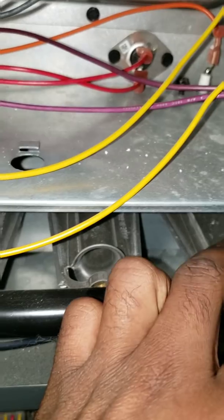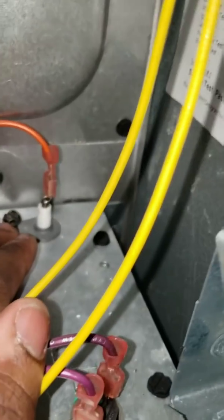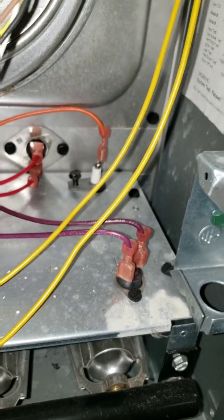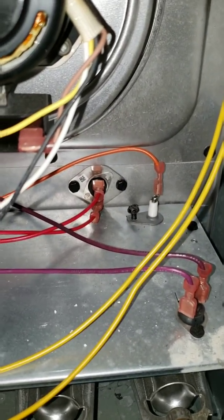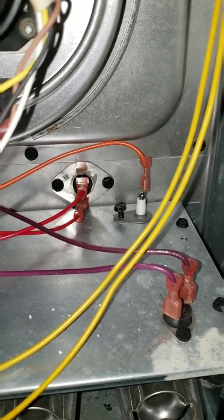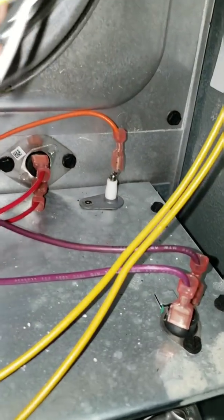When the flame comes out, the igniter is here and the flame sensor is right here in the back. You're going to need a flathead screwdriver for that. You take out the screw, disconnect the wire, pull the harness, and pull the flame sensor out to replace it. The temporary solution would be to just sand it down — and like I said, that worked a full year for me. You'll really need a small screwdriver, and be careful with the wire so you don't unplug anything.